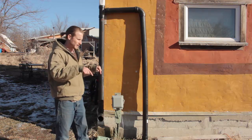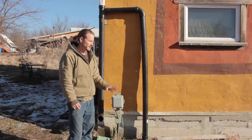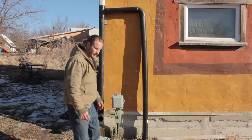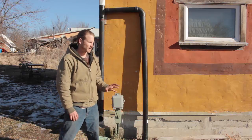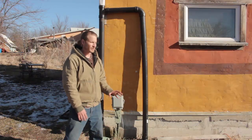The cistern itself is right down here — it's an 1,100-gallon plastic cistern, and I've buried it underground. When I installed it initially, there were many different opinions about how deep it should be. I think it should be as close to the surface as it can be, because you don't have to dig as deep a hole and you don't have to pump up as high. There are some potential hazards to cistern water since it isn't chlorinated, but careful monitoring, proper roof flushing, good filtering, and if necessary a dose of water purifier can all but eliminate the risks.